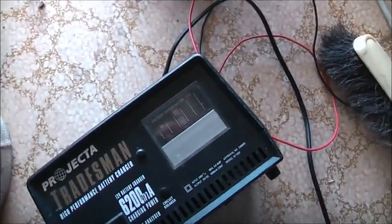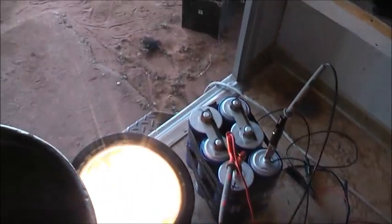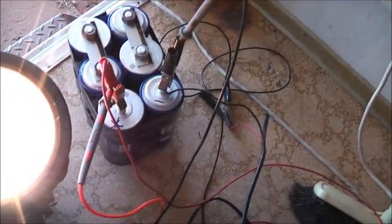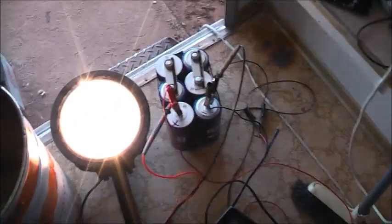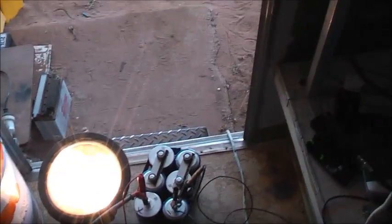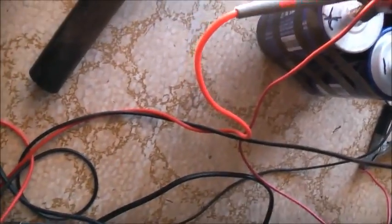Ready for a charge. Let me check and multiply that. Because they're such big capacitors, they behave like a dead short when trying to charge. It's kind of like charging this big bank I've got over here — I have to use a ballast to charge that. Same principle here: it's a short to the charger at the point of trip, so I've got to ballast it down. It will take a while — it's at 1.6 volts. The charger just struggles to charge it without the ballast. Make sure there's a little bit of residual voltage in this thing, because if it runs completely flat and someone tries to jump start you, it's going to be a dead short at first. Capacitors do behave that way. Not getting hot, so that's all right — I'll keep monitoring anyway.